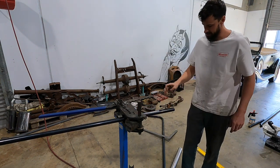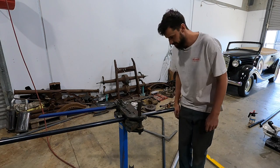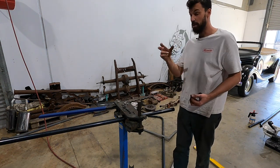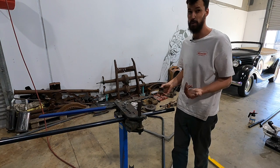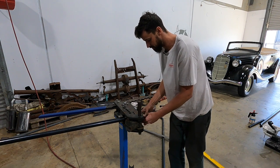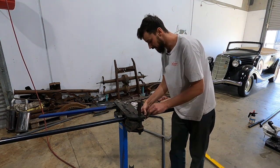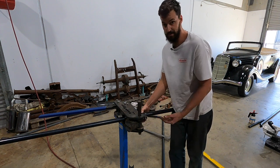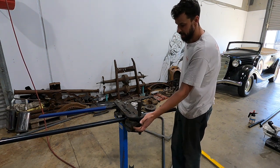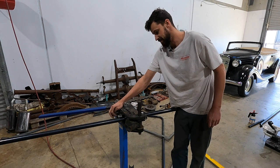And what I'm using is 38 mil, 3 mil precision tubing, also used for speedway applications. Usually I would use 1¾ inch, or 44.5 mil ERW or DOM tubing, when I would do certain things. That's also what I was actually looking for prior to getting this tubing today, because I do have a really nice 1¾ inch die. I do have a 38 mil or 1½ inch die in here, but I do not have the backing for it, I only have the 1¾ one.